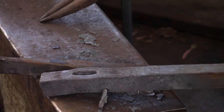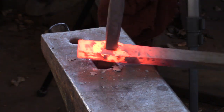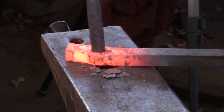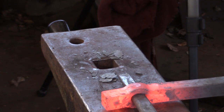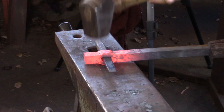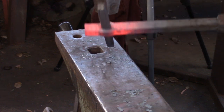Dress the sides of the monkey tool while you're still on the taper to the working end of your drift. As you're working on the taper, I'd recommend drifting from the other side of the bar as well, and then repeating the process. I generally don't quench my drift, preferring to keep it hot so it's not going to quench the edges of the punched hole. I need to work with the drift accordingly so I don't get burnt when handling it.